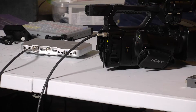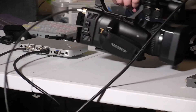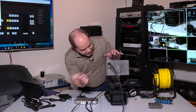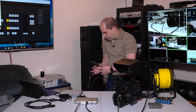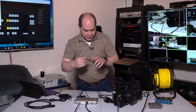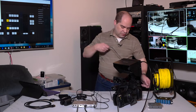The next connection is an HDMI connection for the monitor on the camera LCD — plug that into the HDMI output, then on the back of the LCD monitor do the HDMI input. Then I can start connecting up power — plug into my power strip, connect the power for the camera converter. It's a 12-volt connection. Now we're getting AC power. Then another adapter for the LCD monitor.